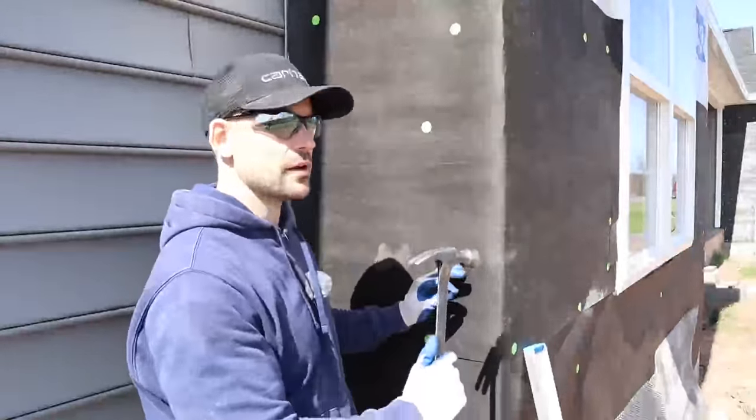If you're wondering why I ran the metal lath over this foundation instead of just sticking the stone veneer to the foundation, it's because if I did that there would be a little lip of mortar difference where the scratch coat meets the foundation — you would notice it after you installed the stone. That's why you want to keep the same plane going down. After I cut these out I'm going to tap-con the metal lath to the foundation to keep it tight. The first job I did I did not run the metal lath over the foundation and used several extra gallons of mortar just to pad out the thickness — that's why I always run it over now.